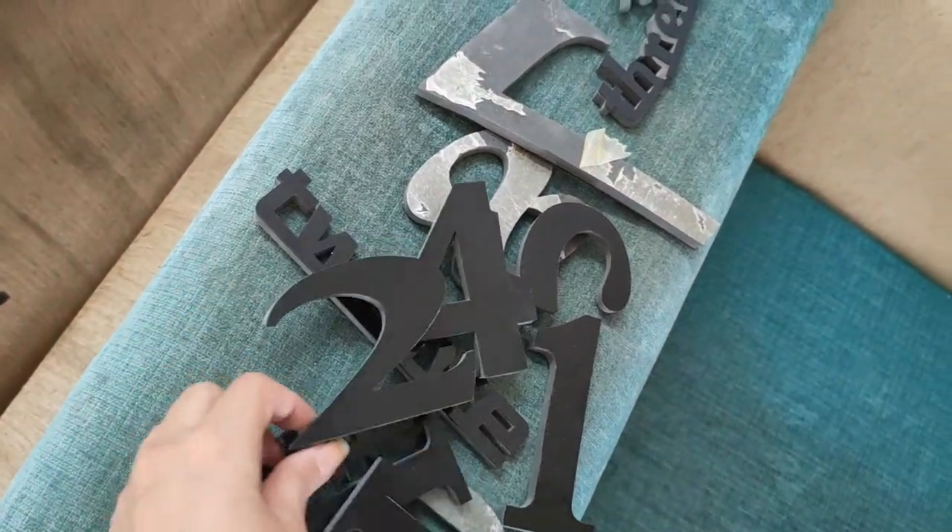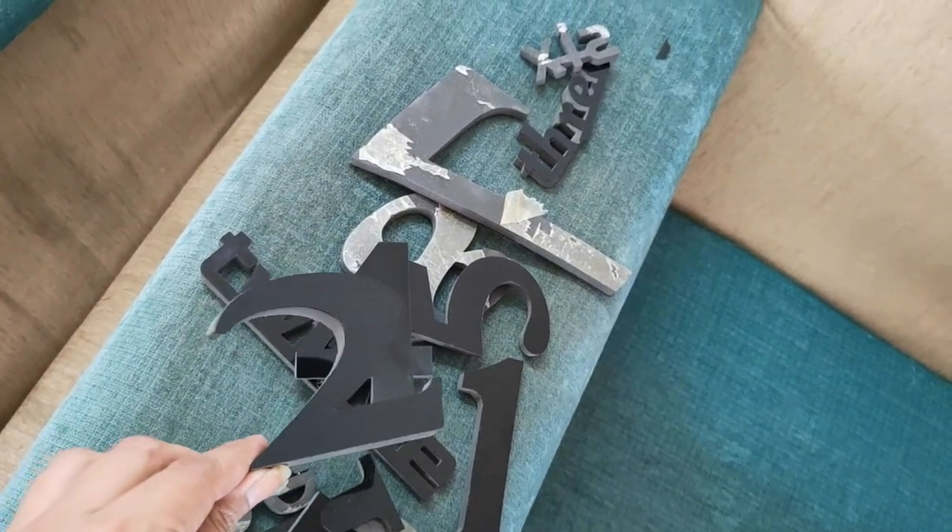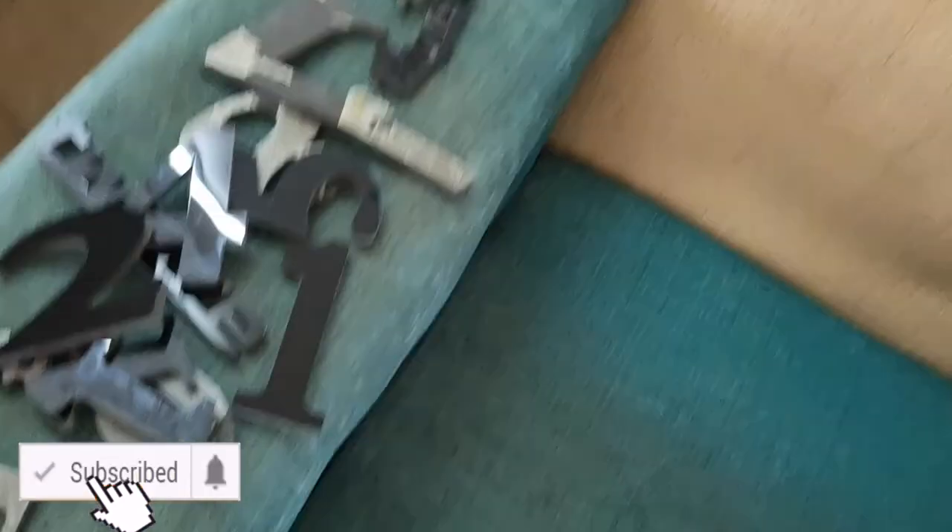You can reuse the digits using double-sided tape at the back, but I will not use them again because after removal you get this — I don't want to spoil any of my walls again. So yes, removal of DIY wall clocks does stain your walls and does chip off the wall paint as well. The process I followed here is: use a hair dryer to heat up the number so the glue loosens, then pull off the digit. Do not pull off the number directly without heating it up, because it is going to chip your wall paint otherwise.